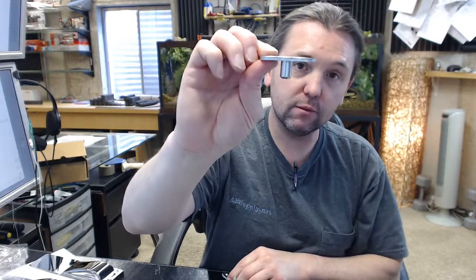Okay, those center lines are called out. The edge of the door to the center line of the pivot is specifically called out. Then your 5/8 on either side of that center line. Okay, the depth is called out as well. 5/32 of an inch. That's the header portion. That Forstner bit will give you a very clean cut, which is why I like to use it, because that header portion you'll see. And then, of course, your door portion, which you will not see, is the same physical dimensions. Okay.